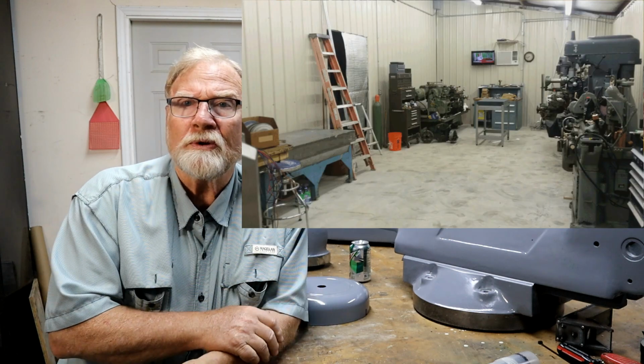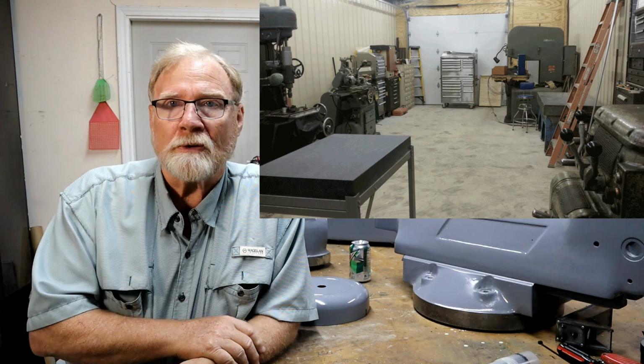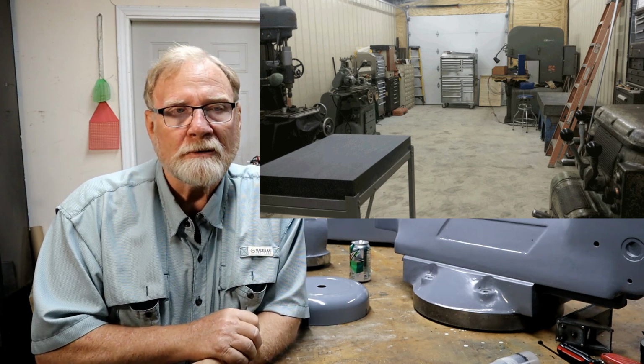But I really didn't want it out here. I wanted it in a climate-controlled area, because when you're scraping things like that, it's nice to have everything at the same temperature. Wild swings between 105 and 30 are not good. So I made the decision to put it in the new addition. Only problem was, because the roof sloped down, I was only able to put a 10-foot tall door in there, and I couldn't get that machine under that door if it was all together.